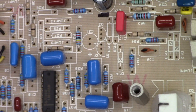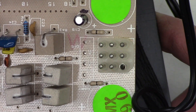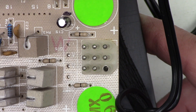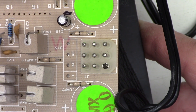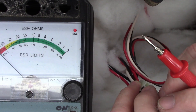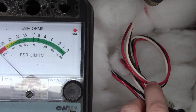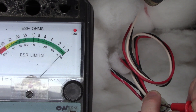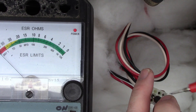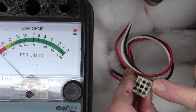I've got all the capacitors replaced on the circuit board with good high quality Panasonic capacitors. I also want to go ahead and retension that one contact in the lower right-hand corner as well as the other contacts in the speaker box, and check the ESR of the main filter capacitors as well. Here is the connector to the speakers and from the power supply. Lead integrity is right at zero — that's what I want to see; anything above zero is a problem. Zero, perfect. Zero, perfect. The main filter caps are good — I can even put those two in series and they're still absolutely zero. Absolutely perfect.